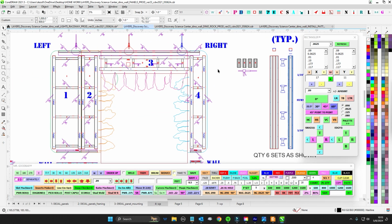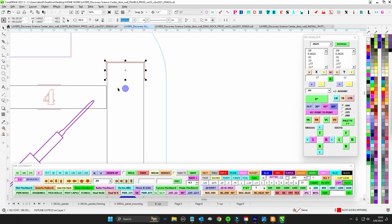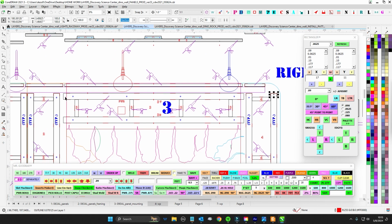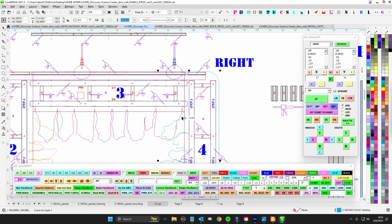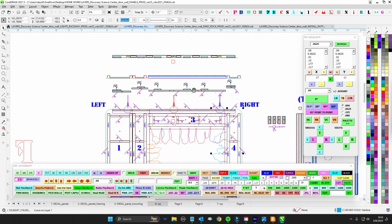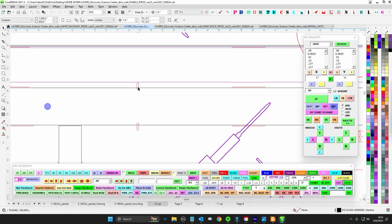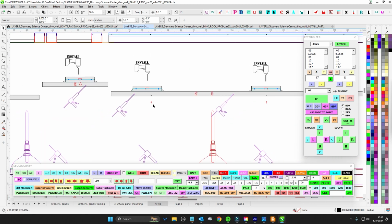Now, on the verticals, we have these long verts here that I was able to put an end cap kind of area where you line it up at the end there and you line it up at the end there. On this guy here though, because I wanted the boxes to extend over the edge to help solidify or stabilize this seam, when you go to put these panels on, it'll kind of rest on this. Because that way there was no reference for left and right, I went ahead and made these little grooves here, these little reference kiss grooves, and then they will line up with these notches here.